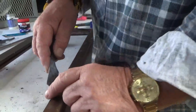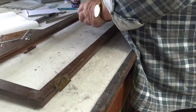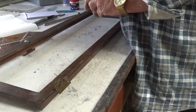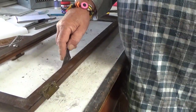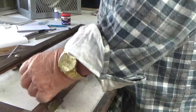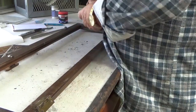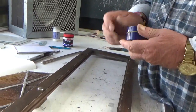Simple as that. But if it was an outside window where you wanted to seal it, well, then you put putty on, and then your glass, and then putty again. But the putty's never on the inside with lead lights. You always put them in dry, and then you seal them. So all the sealing stuff is from the weather side, from the outside. So that's how that works.